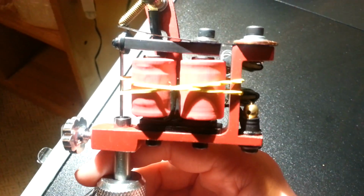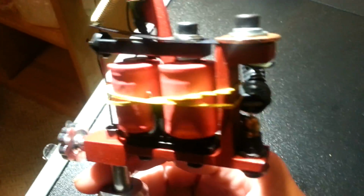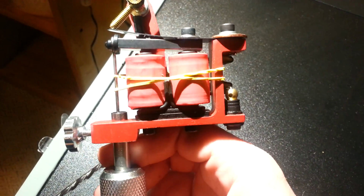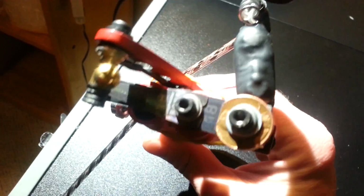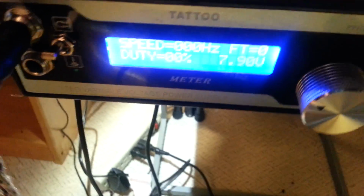Anyways, they're iron cores, T-tops. You can see the thin on the bottom. Nice T-top cores. Just black plastic washers. I cut it out of some random plastic I had. I needed 2 iron yokes, though I don't really need the yokes. It was just really to raise it up. A medium-sized armature bar, 18 gauge Ringmaster springs front and back, 832 binding post, all matching hex bolts. You can all see they're the same. I cannot stand different size screws on a machine. Anyways, 9 volts.